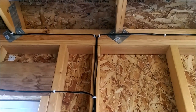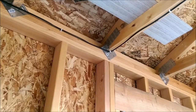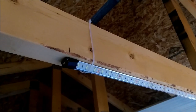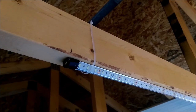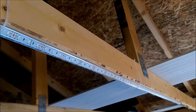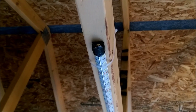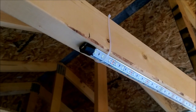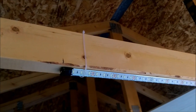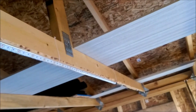Here I have the wire going up — one light on this side and one light on that side. So let me give you a closer look at the LED strip lighting. I have two four-foot sections, and the strip lights are stuck to each side of the four-foot bar, so that's eight feet of strip lighting per bar, and I have two bars. You can see it's zip-tied straight to the rafter three times, and then it's just wired up to the battery.